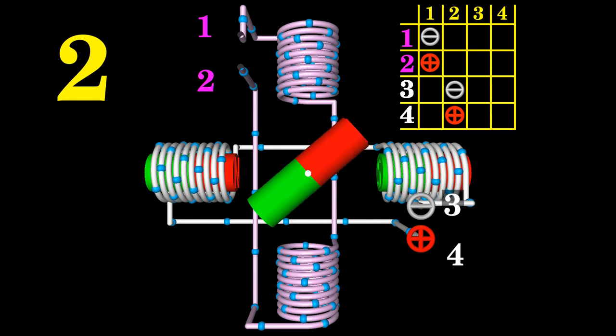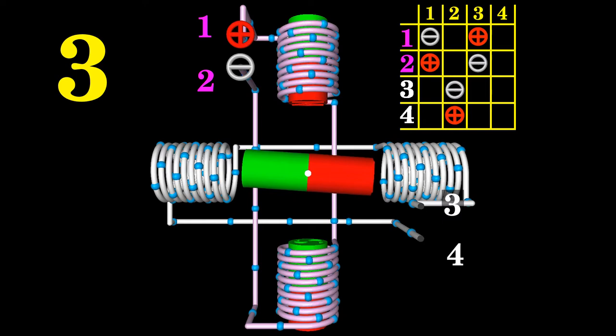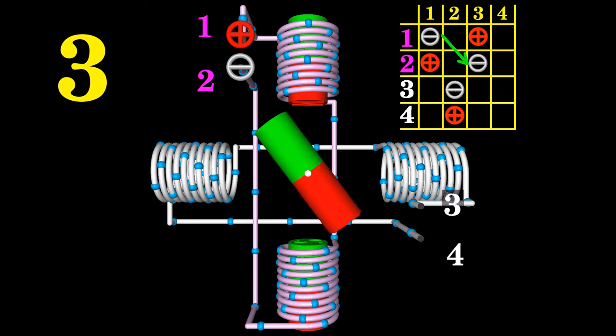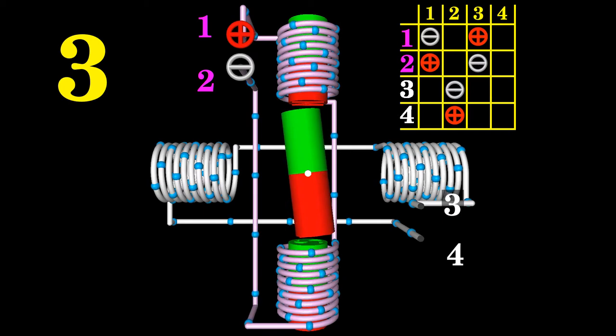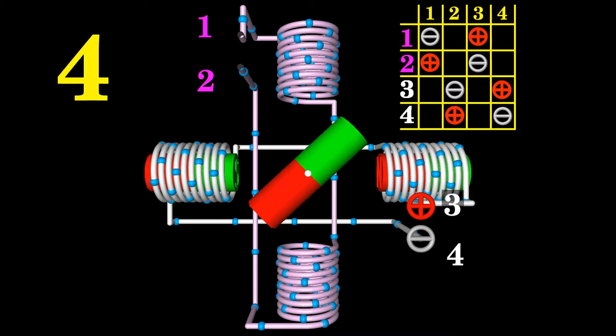As soon as the bar magnet is released, the motor shaft spins another 90 degrees, doing a second step. Next, the horizontally aligned electromagnets have to be disabled while the vertically aligned electromagnets have to be enabled again. To make the permanent magnet continue spinning clockwise, the north poles of those electromagnets must now point to the bottom of your screen. To achieve that, the positive terminal of the voltage source has to be connected to the upper end of the wire, thus to terminal 1 of the motor. The polarity of the magenta colored coils is reversed in comparison to step number 1.